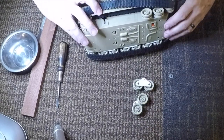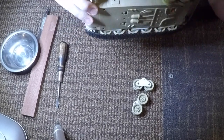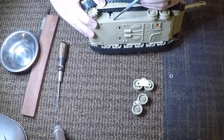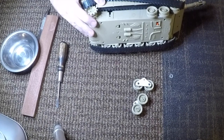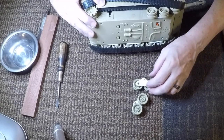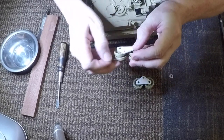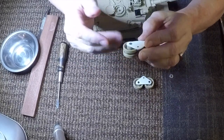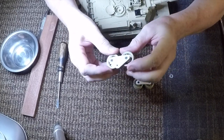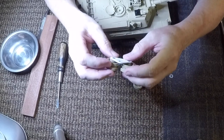we have a little problem here with the motor being right there. Now, if you can see that, the motor's right there. And they created this little angled piece here that juts out so the motor can fit in it. So with that, you have to make sure that your screw is small enough to be able to fit into that. And again, as you can see, the wheels turn very freely because they're still on their original shafts. You just cut them and put them in.